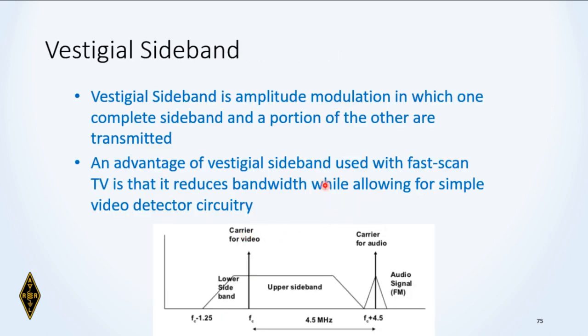A little bit more on the way that they transmit. Vestigial sideband, and this is blue, so we're going to see this again. Vestigial sideband is amplitude modulation in which one complete sideband, which is the upper sideband, and a portion of the other are transmitted. The lower part is semi-filtered. An advantage of vestigial sideband used with fast scan TV is that it reduces bandwidth. It's still 6 megahertz altogether. It's pretty broad,